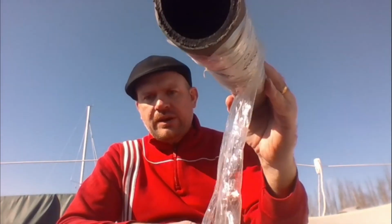So anyway, I bought this adapter, which I'm going to try to get into the stainless steel tank. And this is brass and the tank is stainless steel. I hope that's not a problem with corrosion or whatever. Then there's this quite sturdy rubber hose that goes onto that adapter from the tank, and it has to go out to the top of the boat with one of these lids, so that I can have the hose from the septic tank and then empty with a pump here in the harbor. So that's an important project to do, as well as the propeller.